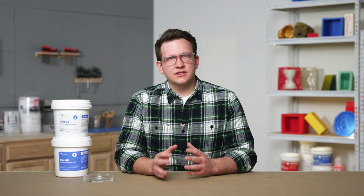Reviewing our mold design, we know that we don't need a substantial amount of elongation since our master is easily accessible and simple to remove. We have a scale at our disposal, so the measurement type, either by weight or by volume, does not impact our decision. However, if you do not have a scale, then choosing a silicone that can be measured by volume will be important.